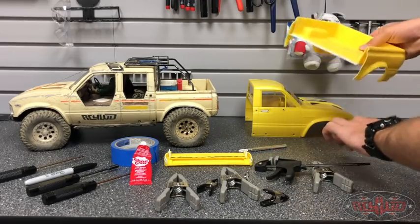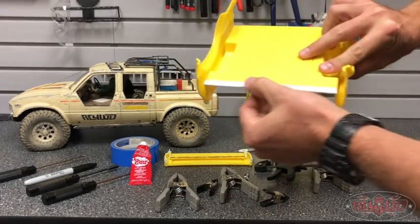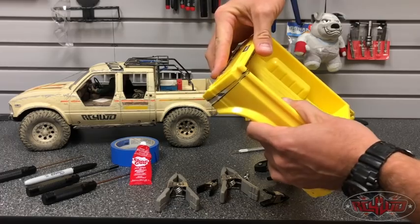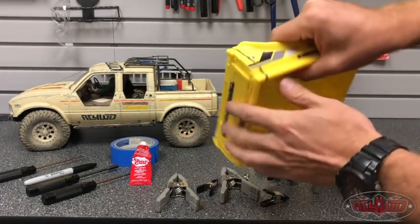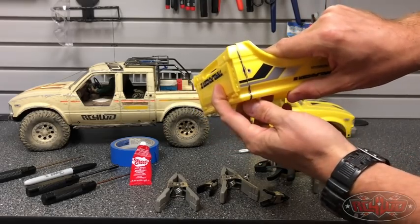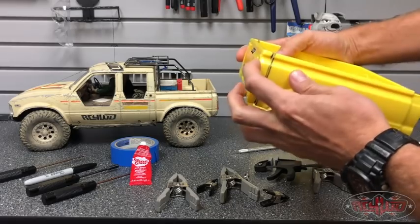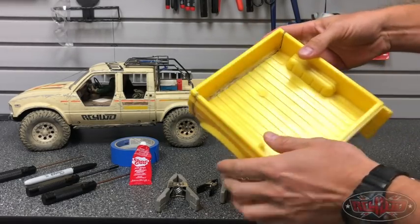Take the clamps off this side and put a mounting tab all the way along here, so that's going to help keep the bed together. So you can watch how it just goes together like a puzzle piece right there. Everything lines up pretty well. The next step is going to be clamping this all together and using a little more glue.